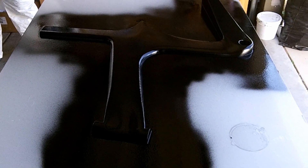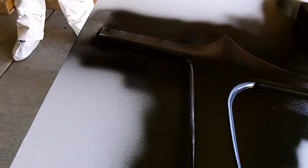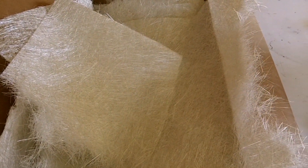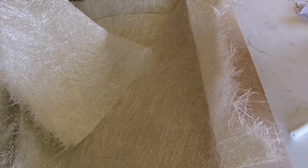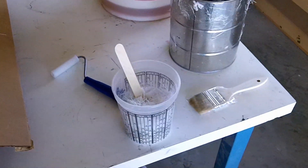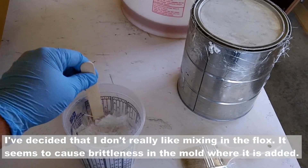Here's the plug after it's been gel-coated. I put the gel coat on really heavy so it's a little bit orange-pilly — no big deal though, that won't make any difference at all. I've got all my material set up to make the mold here. This is a fiberglass chop strand mat. I buy the two-ounce and then I un-peel it so it becomes one-ounce cloth. I just find that it's easier for me to work with it that way. The next thing I've got here is a cup full of cotton flocks and some of the chop strand mat in there.